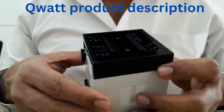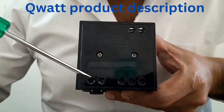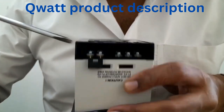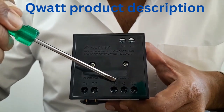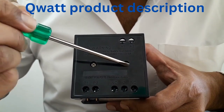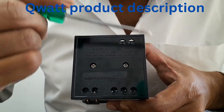Coming to the back terminal — this is how it looks like. It has got two terminals to connect the source. If you are applying 240 volts you have to connect two wires to these two terminals here. Below that you have P1 and P2 — when you short it using the link provided here you are making this product enabled for programming. If you remove the link you are disabling the program so that no one can program this product. Next to that this is where you connect the load — it has got one relay output called as common, NC and NO: common, normally closed, and NO. Three terminals are there. And there are two screws here — by removing these two screws you have to place the cell. The caps can be opened using this, and I will show you in the next video how to remove this and how to place the battery here.